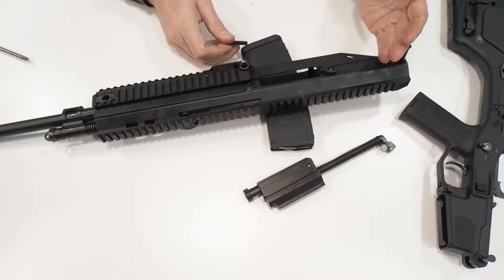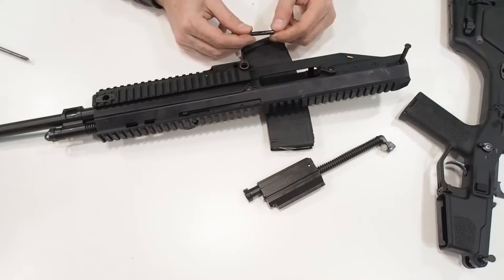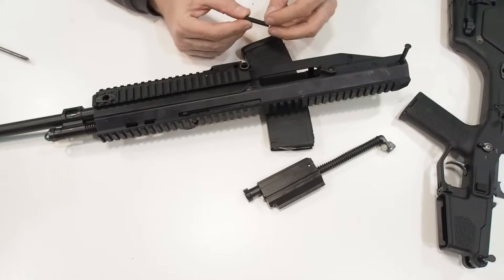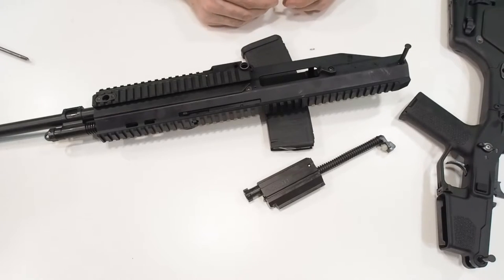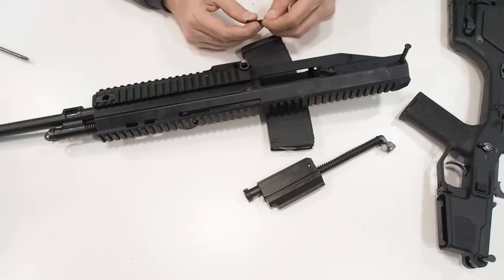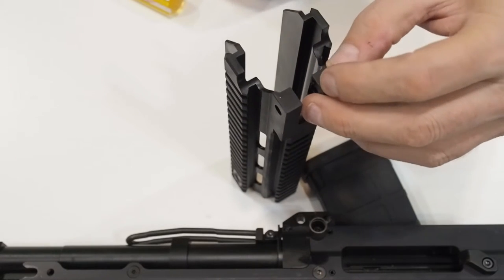In this video clip you can see what happened the first time I took the forend off this rifle. It was a little odd how easy it was to get the pin to move — much easier than any of the other pins, with no clear snap as the detent plunger overcame the retention divot. The pin came all the way out, which allowed the plunger to spring right out — luckily it hit my hand or I'd have never found it. The spring took a trip around the room, but after a while with a flashlight I recovered it. During assembly at the factory, the assembler did not spin the pin until the plunger engaged the slot, allowing the pin to be pulled all the way out. The story had a happy ending, but I would not have been thrilled about having a brand new rifle disabled 15 minutes after bringing it home without firing a shot.